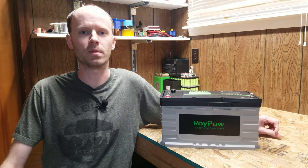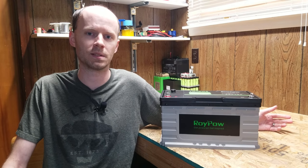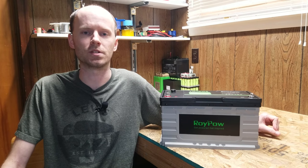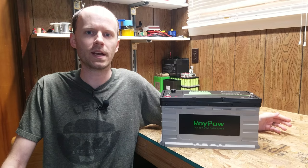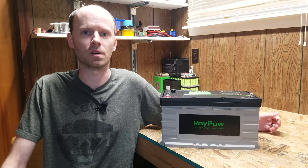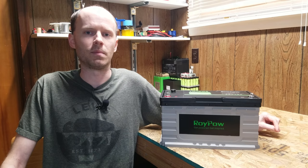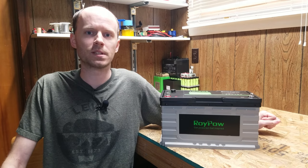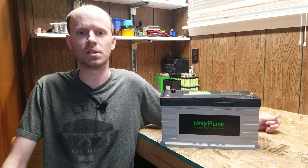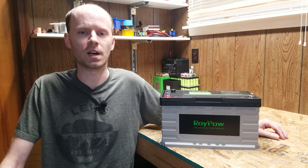In conclusion, I'm very happy with how this battery performed. It was three amp hours short of the advertised capacity, but there are a variety of factors that could have affected that — including charging methods, testing methods, and the fact that it's rather cold in the garage. The proper discharge test temperature is around 75 degrees Fahrenheit. I don't really have any concerns about this battery; it's pretty much plug and play for any application where a traditional lead acid would be used, such as solar systems, RVs, and campers. This battery sells for $699 on Amazon — a link is in the description — which comes out to $520 per kilowatt hour, and I feel that's a very reasonable price for a pre-built battery like this.